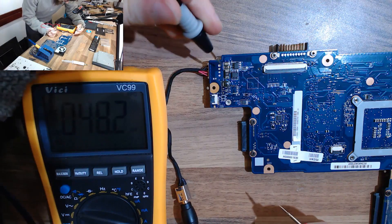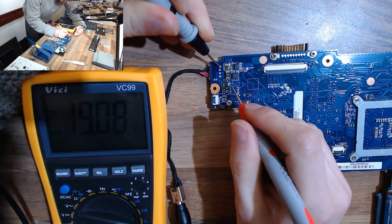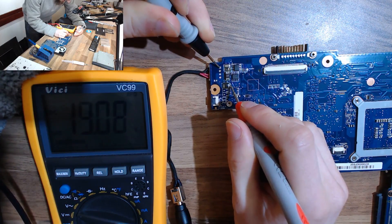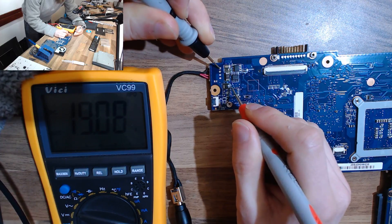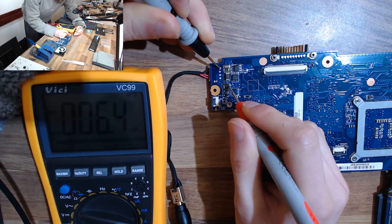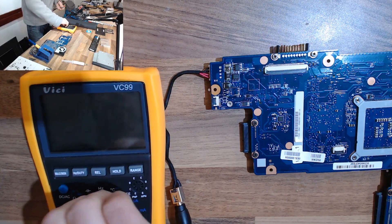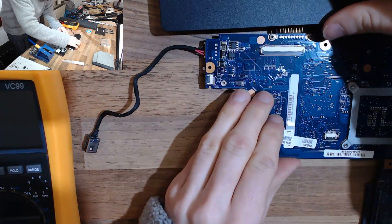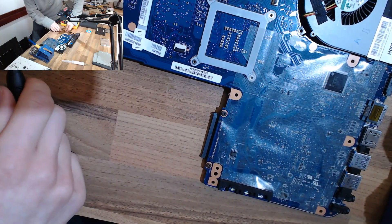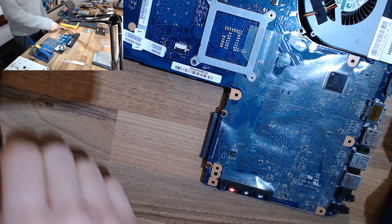Okay, let's check that connection now. One side: solid 19 volts, no hesitation. Other side: solid 19 volts, no hesitation. Previously when I was touching the solder blob it was barely registering a volt or something along those lines, whereas when I touched the actual side of the coil it was definitely giving 19 volts. Now I can just touch the side of that solder blob and we're getting 19 volts straight away, no problems. So that should now be fully functional. In fact, we should be able to plug a battery in and get a charge light. And when I plug the charger in — there we go — we have a charge light! All sorted then. Let's get this thing reassembled and that will be absolutely fine.